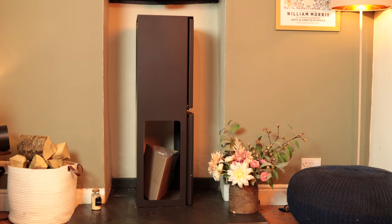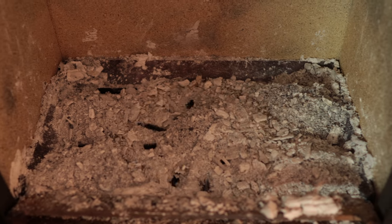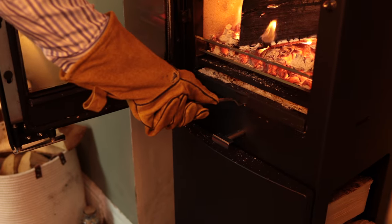And that's just one range of Stovax's — they have about eight ranges. This is one of the smaller ones. You can get DEFRA approval if you fit this little plate, which comes with it as standard — it just stops the stove from fully shutting down. They have direct air as well, and we've got the one with the grate and the ash pan, so the multifuel version. But they also do wood-only versions as standard.